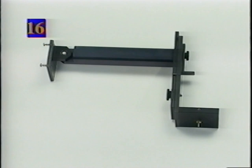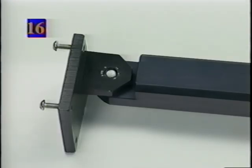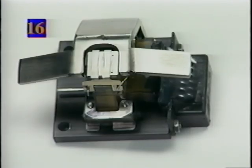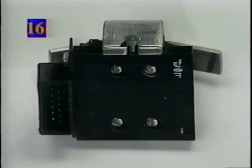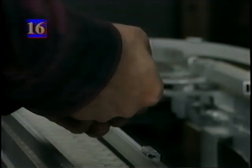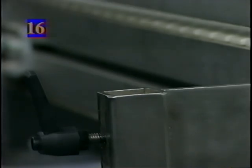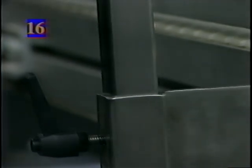The ink supply and the printhead bracketry consist of the septum assembly, where the ink cartridge is mounted, and the printhead swivel bracket, where the printhead is mounted. The drop on-demand printhead comes completely assembled. It just has to be mounted to the swivel bracket. The standard vertical post holds the printhead, ink supply, and photosensor, which allows adjustment from conveyor level to 20 inches in height.